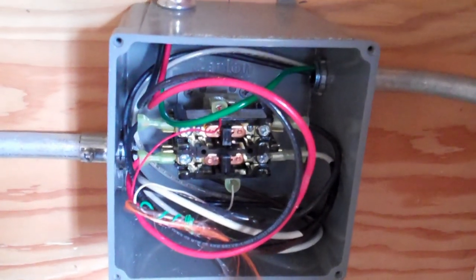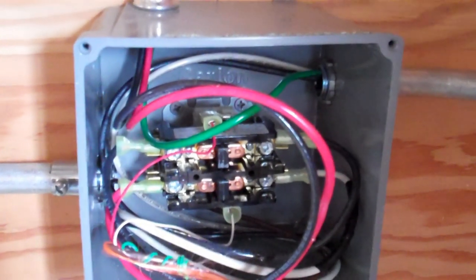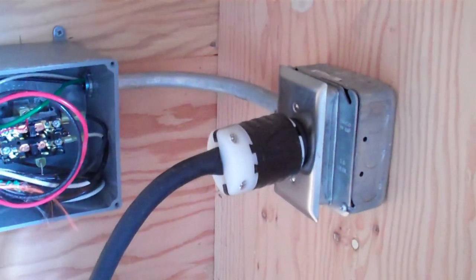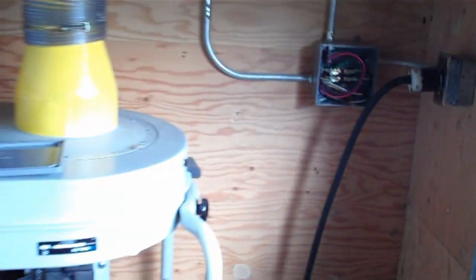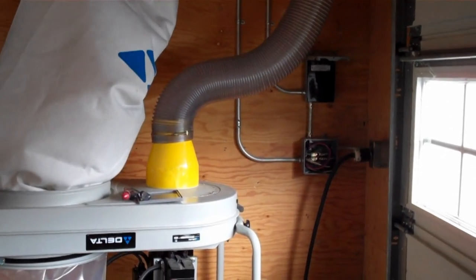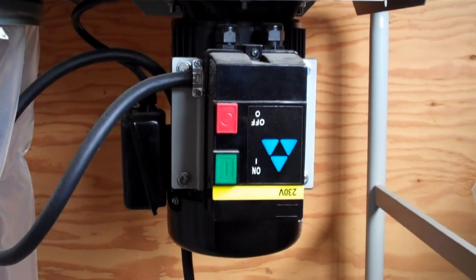In there, the contactor has the main feed coming in on the left and exiting on the right. If you look real close, you'll see a couple of low-voltage thermostat wires hooked to it — those are the actual wires coming from the 24-volt switches upstairs. That power comes out and goes over to an outlet where I have a twist-lock 220-volt cable set up so that I can actually disconnect my dust collector. This allows me to roll the dust collector around — it's on a rolling stand. I've got a piece of flexible hose connected to it to my main dust collection system, which allows me to do some cleanup and maintenance. And here is the motor and motor starter that came with the dust collector.